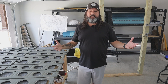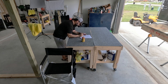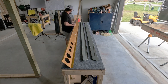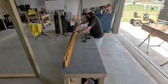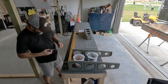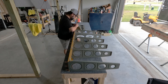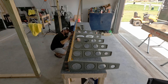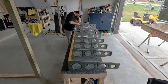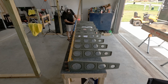So I learned a couple of things while building this yesterday and I'll be sure to point them out. There's a little bit of shuffling because all of those spars are on one long shelf. I put a little gap between the tables so I can use a clamp to hold the flange of the main spar to keep it from tipping. The first thing I learned: as I'm clecoing the assembly together — which is what the plans say to do, cleco it and then rivet it — don't cleco all of it.